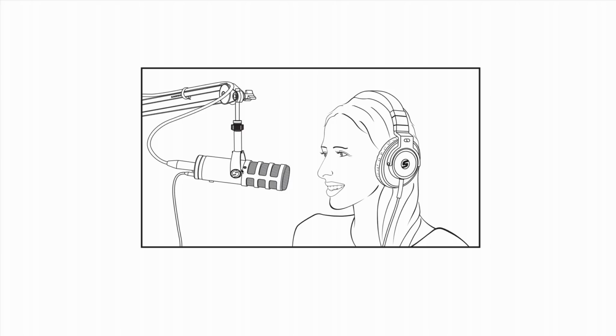But now I realize as I look at this image, now that I'm going to include it, that the image itself is actually wrong. They're displaying it with an XLR cable and headphones. You can't do that with this microphone. That won't work. This would have to be a USB cable because USB can provide power that would power the headphone amplifier. XLR won't work. Even with phantom power turned on, I thought maybe there was some magic behind the scenes that would make it work with phantom power. I checked, doesn't work. So this picture shows XLR and headphones. You can't do that. This would have to be USB to run the headphones. Anyway, hopefully that clarifies how you can angle the microphone in the stand, but also how you connect it to your computer.